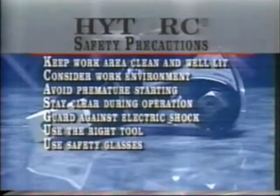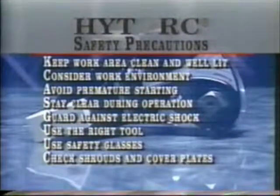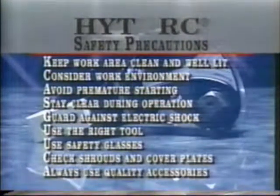Use safety glasses. Make sure that shrouds and cover plates are in place. Never use a tool without shrouds. Always use quality accessories. Make sure that your impact sockets are in good condition, the correct size, and fully engage the nut. Always stay clear of sockets during operation.